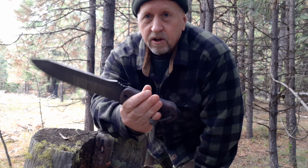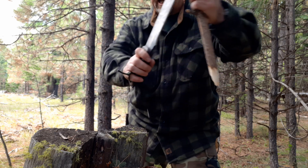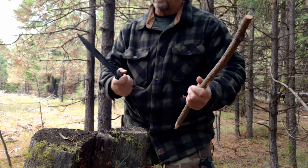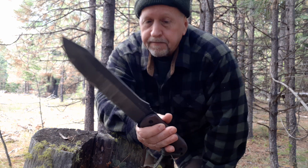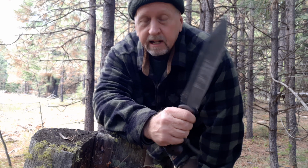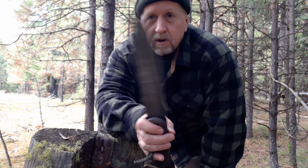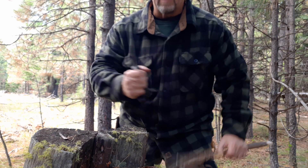Put your own personal touch on it. If you want to put a 90-degree spine on, just rub it over the back of a belt sander while it's spinning a few times — you've got your 90-degree spine. Get some paint stripper and some 1,000-grit sandpaper, take that coating off, soak it in vinegar for an hour, and you'll have a patina on it. Then, whatever you like for a sheath.